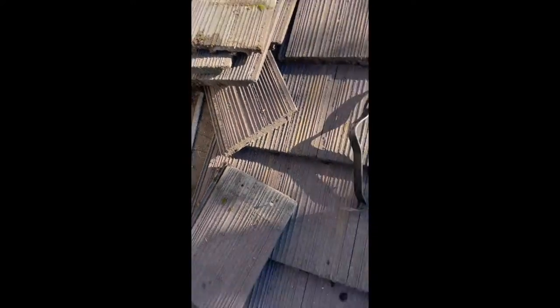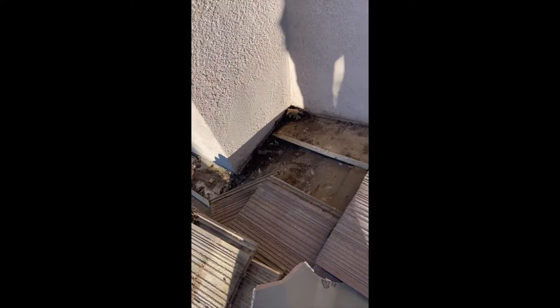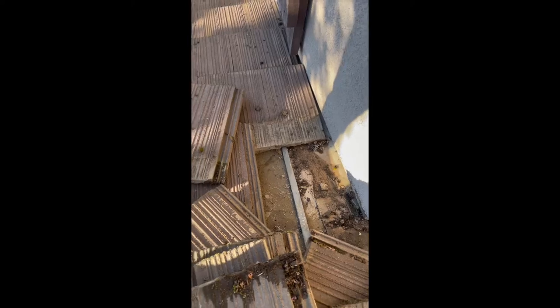So above there, I found this tile broken, but that's probably not the cause. I started taking this apart. There's a little bit of a jut out here, so water comes down and accumulates in there. Pulled all these tiles and found the felt paper was wet and some of this flashing down here was clogged up. It has a crimped edge — it's been flattened. Felt paper's wet going down around the corner down here.